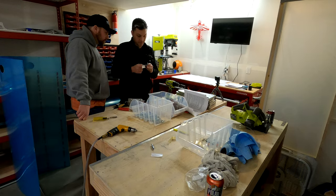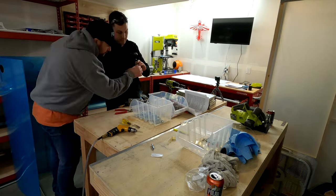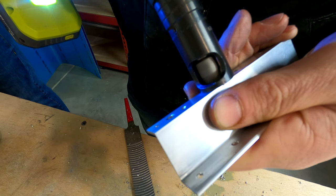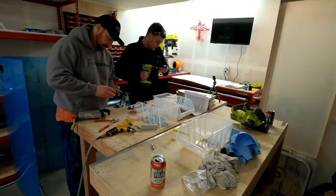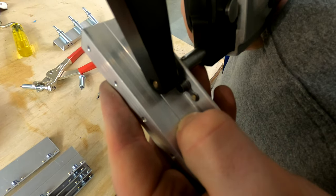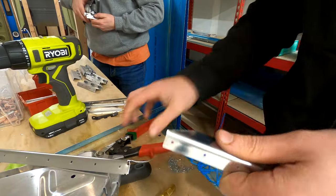Let's step back a bit. The fuel tank construction is remarkably similar to the leading edge. There are some differences. First, there's a number of brackets that have to be fabricated that hold the fuel tanks to the spars. These brackets are constructed from Z-bent aluminum that has some holes pre-drilled from Vans. The holes will get some nut plates and need deburring and the usual treatment. In addition to that, some other differences include stiffeners that will go on the skin of the fuel tanks.